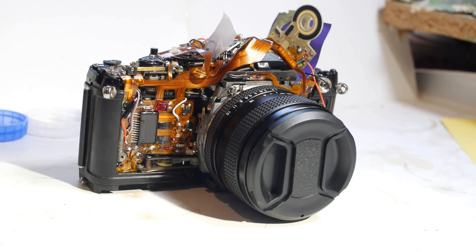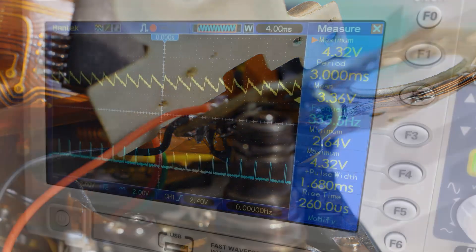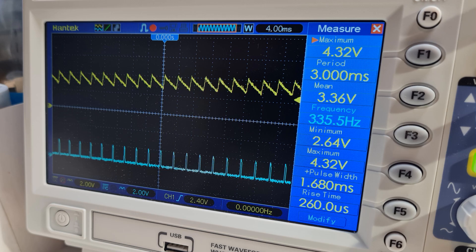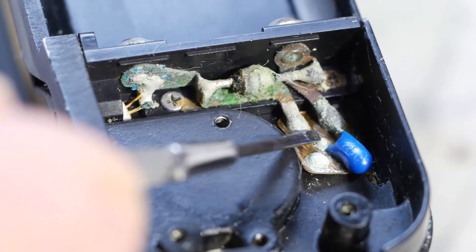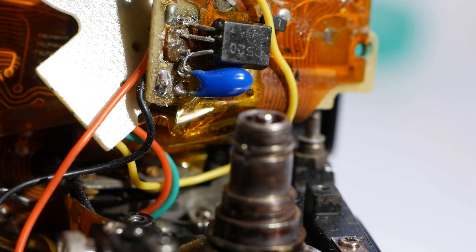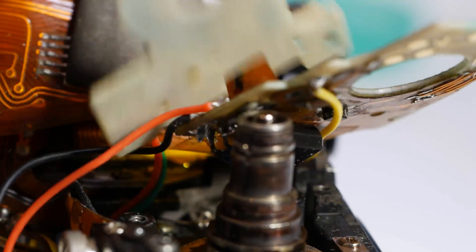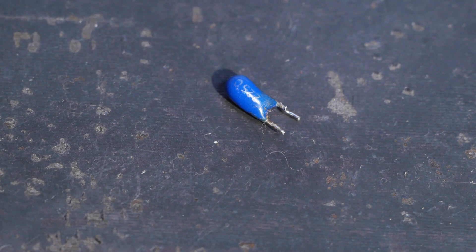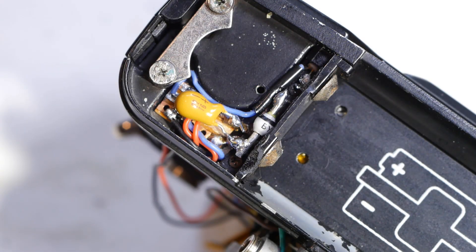At that point I walked away again for a few days, still thinking about the project all the time. On the odd occasion that the camera had partially powered up while the oscilloscope was connected to the voltage regulator, the output seemed to be very noisy — more like a sawtooth than a nice smooth trace. There are a couple of capacitors listed as preventing oscillation of the constant voltage IC. One of those goes across battery plus and minus, with the other one located next to the voltage regulator itself. I'd had those out previously and tested them, but that was before I'd applied any power to the camera. So I popped them out again, and the one across the battery terminals had a very low capacitance and a high resistance, so I replaced that one with another 22uF tantalum capacitor, checked a few more things, then reassembled the camera to try again.